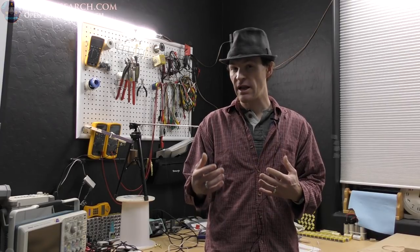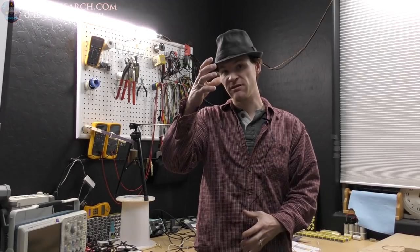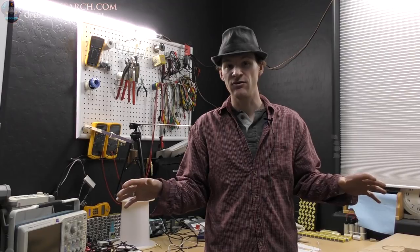So if you look at how a single wire interacts, and then you tell yourself, but I want to also generate a magnetic field that I can interact with a magnet, then if you want to get rid of as much of Lenz's law as you possibly can, and you want to induce currents in one direction, you only interact with a single wire, but yet you need a solenoid to create the magnetic field in the same type of orientation as your magnet. So everything's at 90 degree angles.